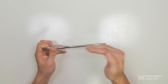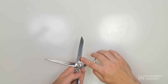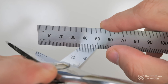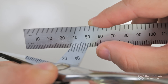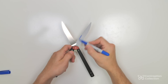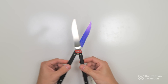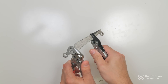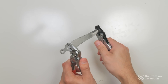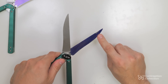For too long I focused on this curve of the blade, but not this curve. Scissors typically have a hollow ground into their backs — they aren't actually flat. This ensures they're only contacting at the edge when cutting. You don't want the inside parts rubbing together. I put marker on my blades and they didn't seem to rub together. Another solution is to put a twist into the blades so each blade angles apart, but the rubbing might have started to become a problem now.